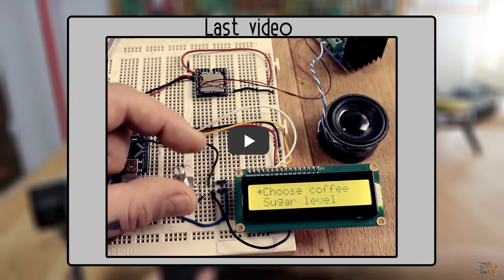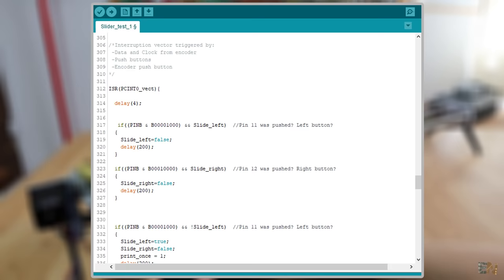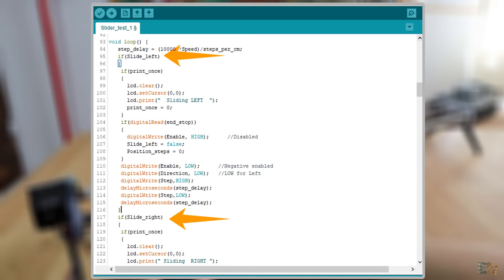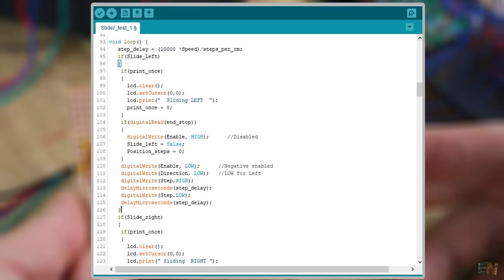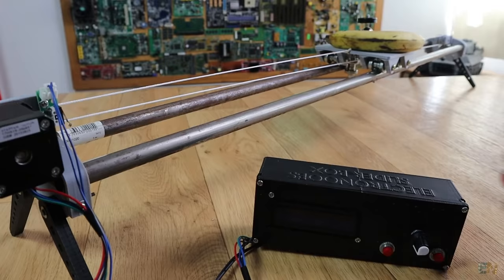See my other rotary encoder menu video to learn more about this, because since I've already done that I won't explain it step by step. Now inside of the code, each time the data or clock pins of the encoder or any other of the buttons change their state, we enter an interruption. By rotating the encoder we increase or decrease the menu position or the speed amount. In the infinite loop, if one of the left or right buttons is pressed, we activate the enable pin for the step motor driver, select the direction — low for left and high for right — and create a square wave on the step pin. The delay between the high and low state of the square wave gives us the frequency and that controls the rotation speed of the motor. Read the code comments to understand how to calculate your delay time depending on the pulley size. Download the code from the link below, compile, make sure you have all the connections as in the schematic and upload the code.